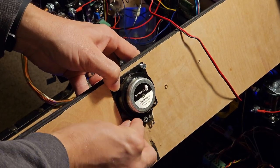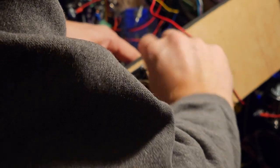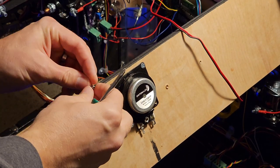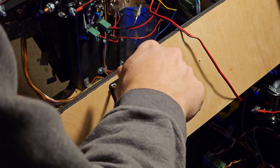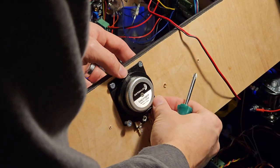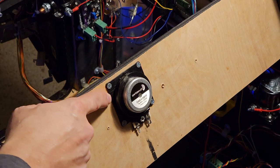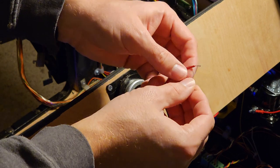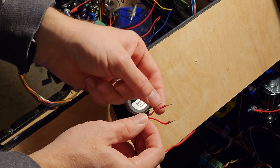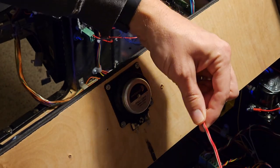Get the opposite corners started a little bit, then screw it down pretty tight but don't go through the wood. These are half-inch screws and they will not go all the way through, which is nice — you don't want to do that otherwise it'll take away from your cabinet's appearance. Don't put so much pressure on there that it cracks the plastic. Then I ran this wire all the way out the back — I stripped the ends and pre-tinned them.